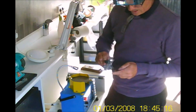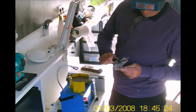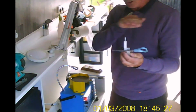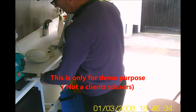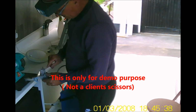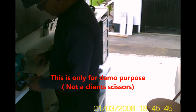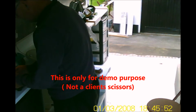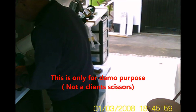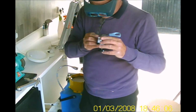So we'll open our clamp, in with our blade, and we lock up the clamp, check that it's fairly level, clamp her up, happy days, out with the arm, in, sharpening side up, on with our machine, our light comes on, and we can basically run across, do our tests, and away. Check our foot there, perfect.